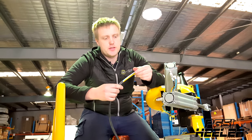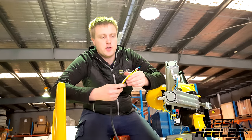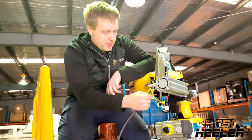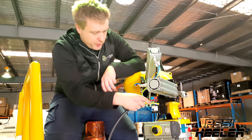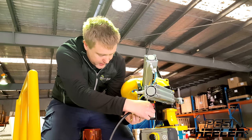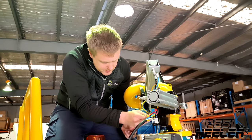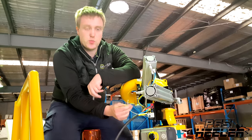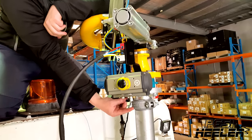Installing the loom to the cannon is quite easy. All you want to do is strip about four inches of sheath off the control cable, exposing the five cores inside, and then just match up the colors to the bulkhead plate on the back of the cannon. You want to try to keep those lines as straight as possible, avoiding any kinks. Once they're connected, the only other line you need to connect is the white line that comes out at the back of the bulkhead plate, which connects to the air inlet on the actuator.